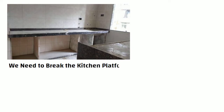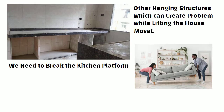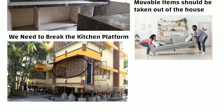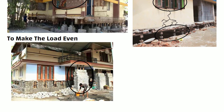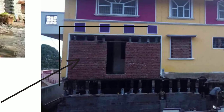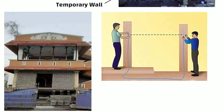The next step is to break the kitchen platform and other hanging structures which can create problems while lifting the house. Whatever movable items are in the house should be taken out. After this, we need to fill the window gaps with masonry to make the load even — if we place jacks below the wall of a window without doing this, it can break the wall and the structure can collapse. Support to weak and cantilever members shall be provided as a safety precaution. Temporary walls shall be constructed below hanging structures without wall support, and MS props shall be constructed below walls where there is no direct wall support. Marking will be done on each wall with the help of water level pipes for even lifting.